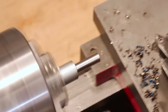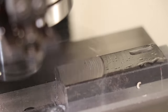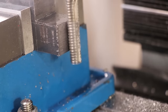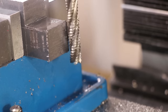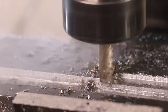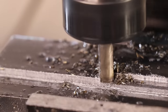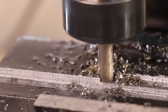This video is more focused on the mill. Not only do we have hot chips being thrown right at us, the cutters are also a lot harder to resharpen, and a tool that's cooler tends to last a lot longer. It's for that reason why I try my best to keep the cut as cool as I possibly can. Since I bought the mill, my go-to method has been to flood the cut with kerosene or a mineral cutting oil, using either a spray bottle or a brush. This works fine, but I want to upgrade it to a more hands-off system.